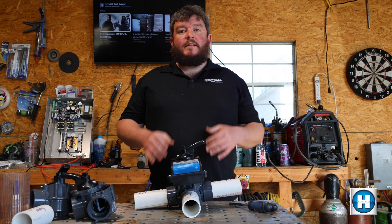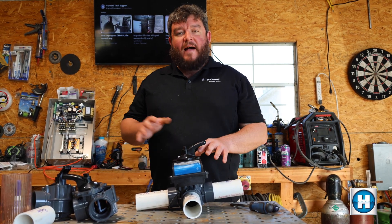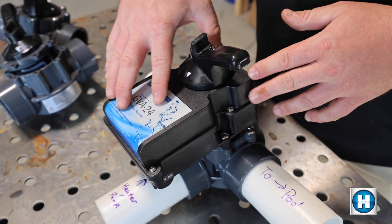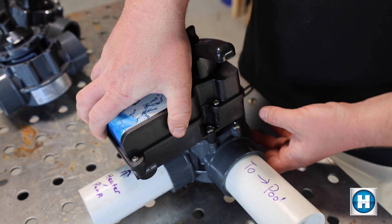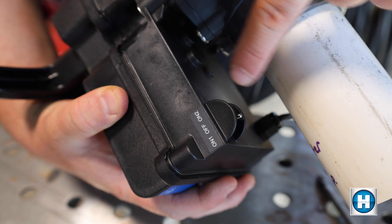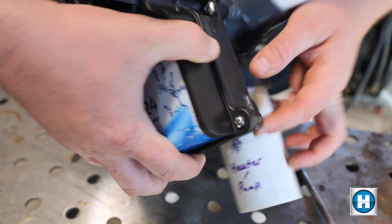If you've got a pool-spa combo — meaning a spa that's attached to your pool — you probably have an automation system with valve actuators connected to it. This box right here is the valve actuator; it mounts onto the three-way or two-way valve. I'm going to flip it over and show you the on/off toggle switch. You'll see: on one, off, on two — it's like a double-pole switch. In on-one, the valve will be in a certain position; the middle position is off; and on-two rotates the valve in the other direction.